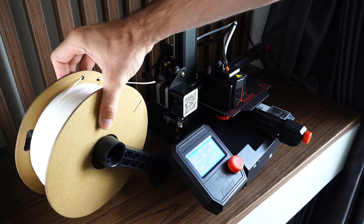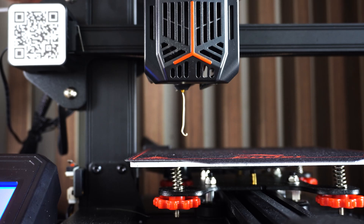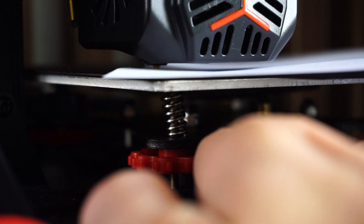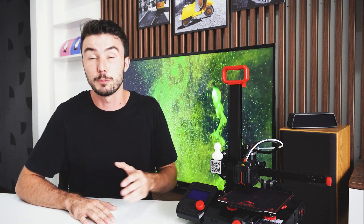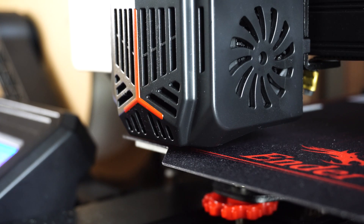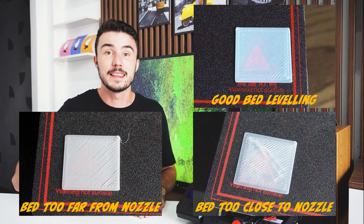The printer uses standard 1.75mm filament and loading it is as simple as using the preheating settings and sliding it through the bowden extruder until it comes out the nozzle. To level the bed, I start off with a few rounds of the paper method until each corner provides some friction between the build surface and nozzle when moving the sheet across. Note it's better to do this before you insert your filament but after the printer is preheated. To then really home in and get your bed perfectly level, I use Teaching Tech's method of printing four squares, one in each corner, and using them as a visual guide to make those final adjustments. You're looking for the individual lines to be touching but not so close that they merge together and not so far away that there are gaps.